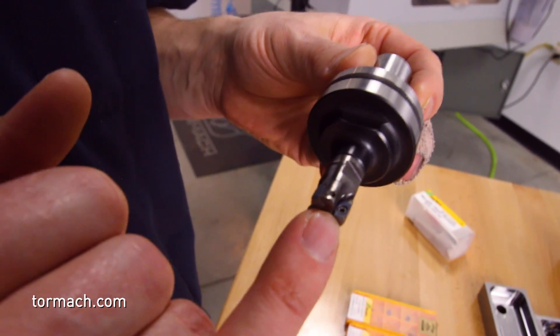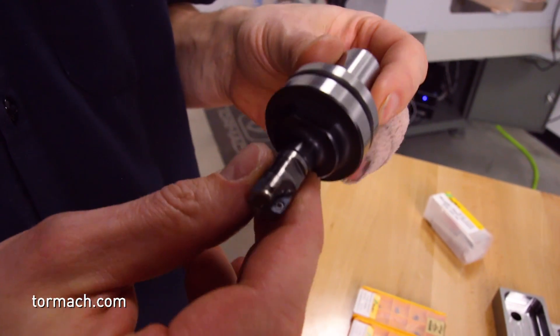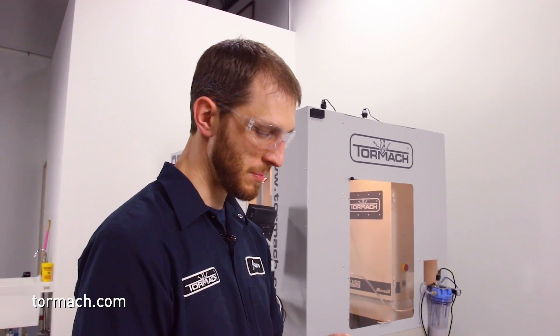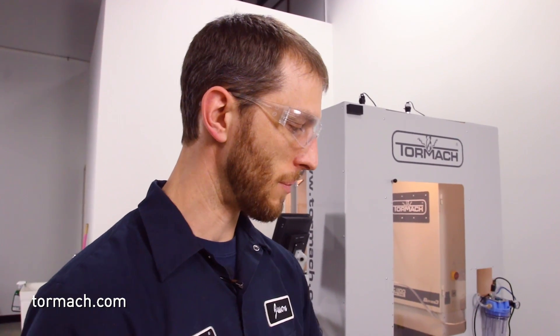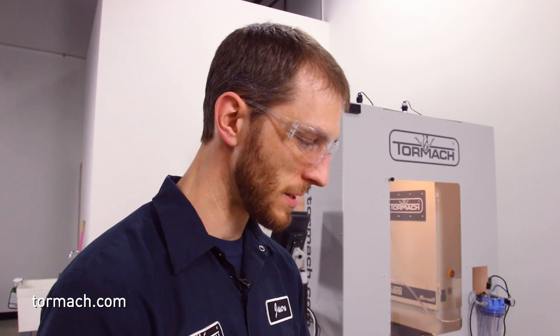It's a modular style cutting head, so we can fit it onto any of our three different lengths of six millimeter holders. This is an M6 holder — we have a short, medium, and long. This one is currently set up with the short holder. As always, keep your tools as short as possible, but in some of the cutting footage we're going to run through, we'll use the long holder and test them in all the different scenarios.